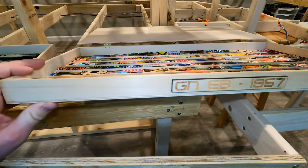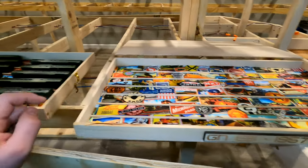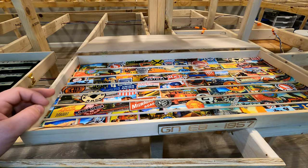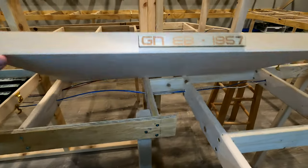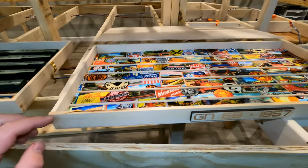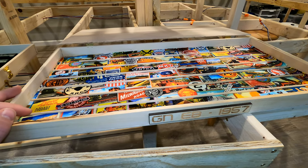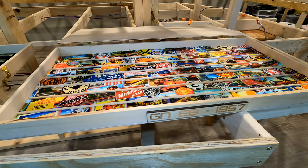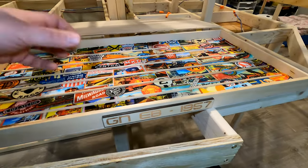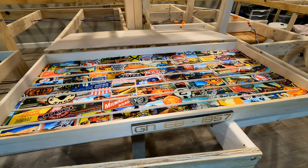I then cut this to about 1.5 inches, so you can get both the front and the back and then the two sides done, and you can start to get another box out of that one 24-inch piece. They're usually about 5.5 inches wide, and then they're just glued together — there's really nothing special to it, it's just basic wood glue. No nails, though if you wanted you could put in a thin 22 or 24 gauge nail. I built these two or three years ago and they've moved from Seattle out to Minneapolis, been in and out of storage, bumped around, and they've stayed together.